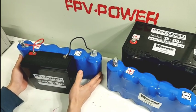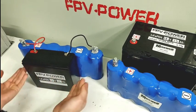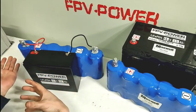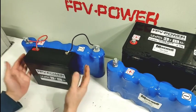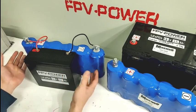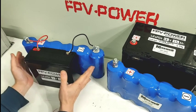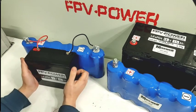A lead acid battery, a deep cycle one for deep cycle uses, they will only recommend 50% depth of discharge. So you've got 100 amp hour, only use 50 at the most, and you get 350 to 400 cycles out of it. So if you do a cost versus benefits and performance comparison of the two technologies, whether you buy a very good lead battery for cranking, versus getting a system such as this that we have made available with supercapacitors and lithium batteries, you find that in the midterm and the long term straight away, and of course the upfront cost is not even that much more expensive, we can even call it a short term investment, it makes more sense to go with supercapacitors and lithium.